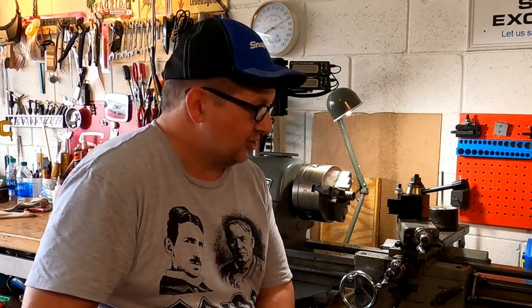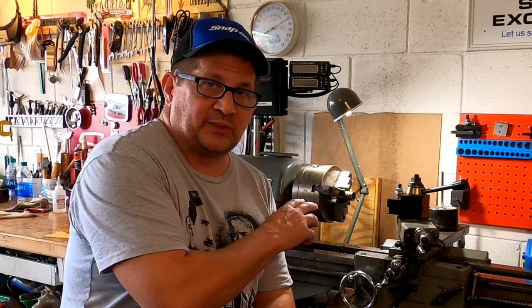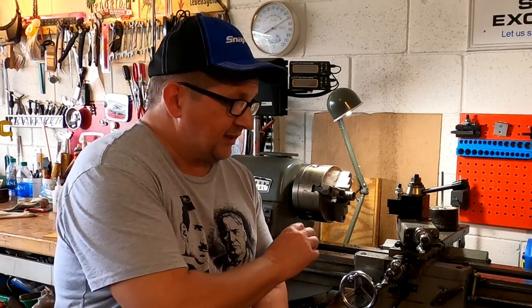The only thing left was the spindle. If the spindle starts getting loose, you're going to get chatter. I haven't had issues with this lathe's spindle being loose, but I've used it quite a lot over the last few years without making any adjustments. We also had about a 30 to 35 degree drop in ambient temperature, and when temperature goes down there's contraction in metals. So I thought we should check the spindle adjustments and make sure we have our preload set so we aren't getting any chatter.